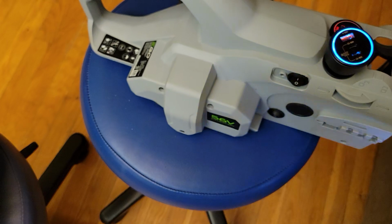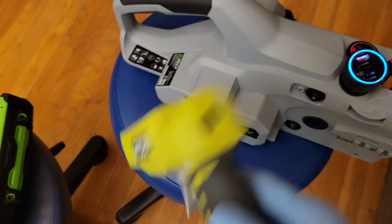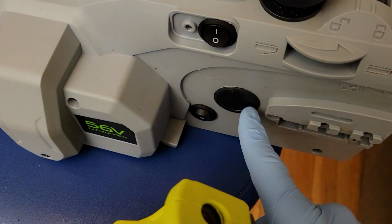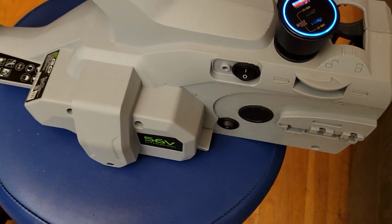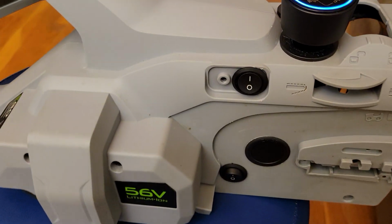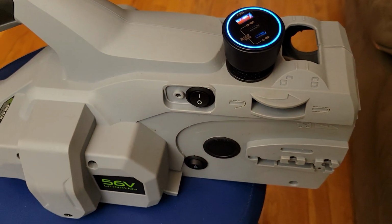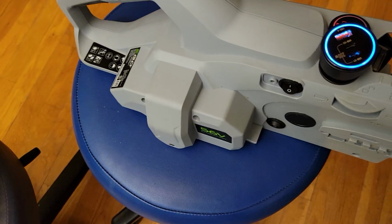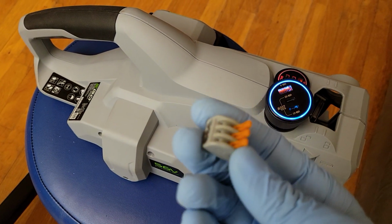And then on the back side, I actually used a little bit of glue from a glue gun to get the back of this just perfectly sealed up tight so it can't move around. If I had an imperfect fit, like this one was just a little bit loose when I pushed on the switch, I used a little bit of glue gun on the back of it to get it to hold steady inside there, and that worked out really good. I also used these little Wago lever nuts on the inside to help me distribute the power.